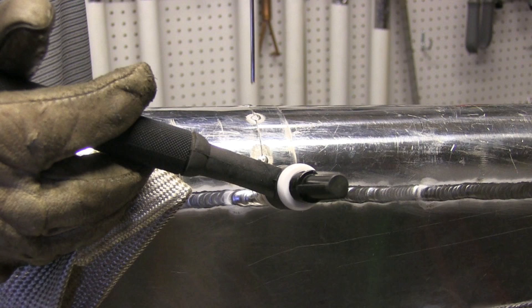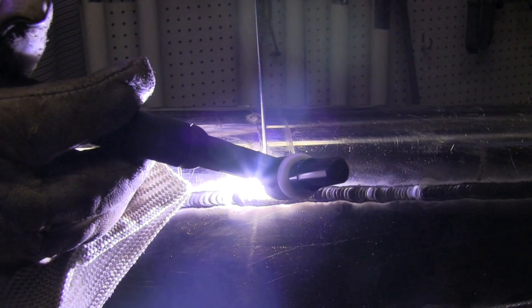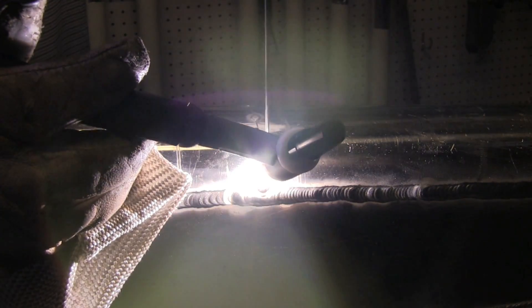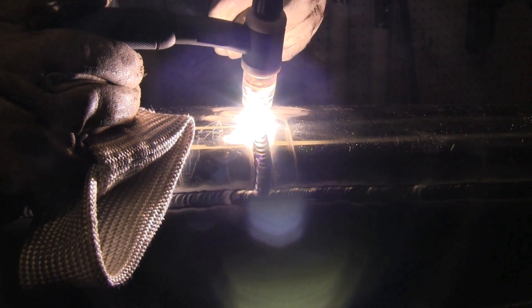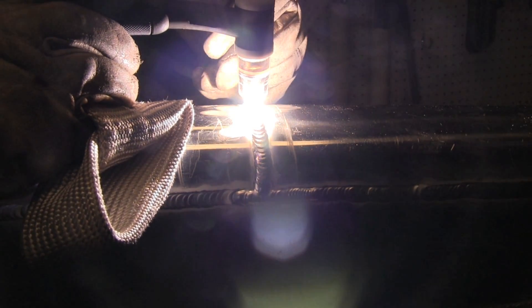Getting ready to weld around this thing now, and what you need to keep in mind here is rotating the torch. Each time you come out of the puddle with the rod, you need to rotate the torch a little bit in your mind. Otherwise you get too much torch angle really quickly on a round part — and it's worse with small diameter stuff. If you don't keep it in mind, it's easy to get out of scope. Every dip, kind of rotate and clock the torch around and aim for the center of the tube or pipe — it really helps things go a whole lot better.